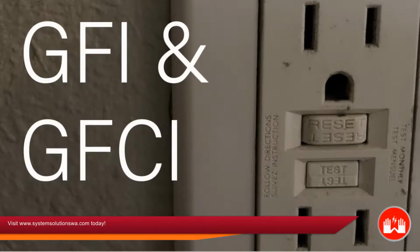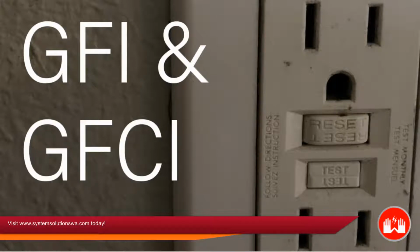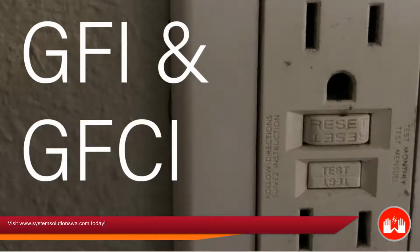Tripped ground fault circuit interrupter outlets. One of the most common reasons for your outlet not working is that it is wired with a ground fault circuit interrupter outlet, also known as GFI or GFCI. The outlet could also be a GFI itself. A GFI outlet typically will have two buttons in between where you plug in your appliance. One is labeled test, and the other button is labeled reset. There may be a light between the two plugs as well. The color of the light, or if it is on or off, will indicate the outlet's power status.